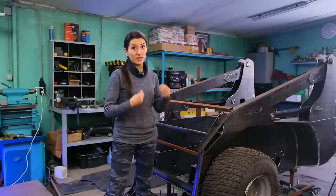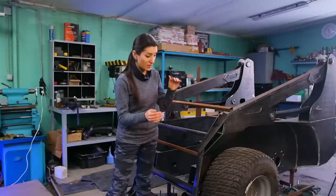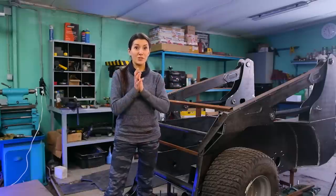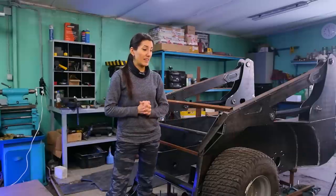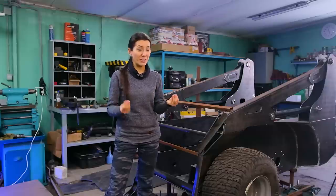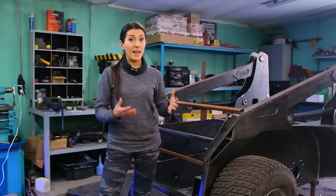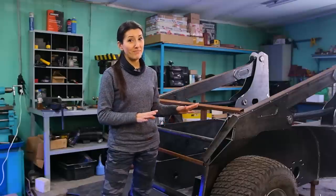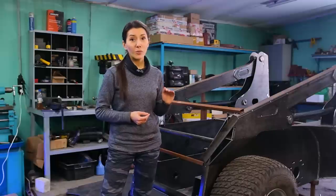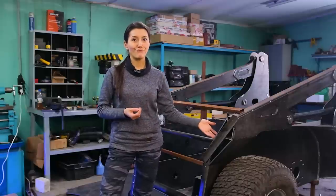And I assumed that I would shorten the hydraulic cylinder rod by 6 cm and it seemed to fit in there well. My mind was blown by thinking about the articulation of all these plates at that moment, and I just forgot about the exact calculation of the hydraulic cylinder insert. Simply forgot. And now, when lift arms are almost ready, I understand that even if I shorten the cylinder rod, its upper hole will be located here, where I have nothing to attach it to.